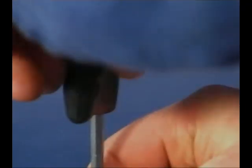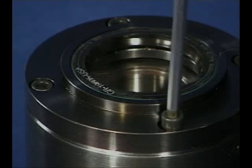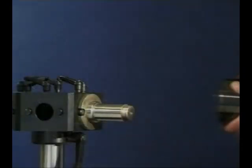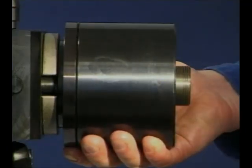If the bearings are grease lubricated, it should be done at this stage. The bearing should be kept in its protective package until the actual mounting takes place. The housing assembly is placed on the shaft and, whilst partially supported, fit the second cone assembly.